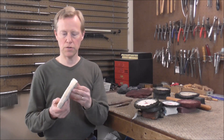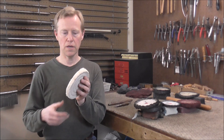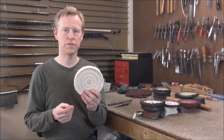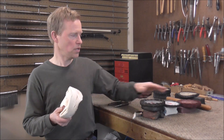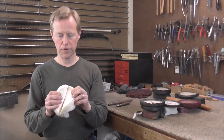The next one I use is similar but about twice as thick. This one works well with the Tripoli and Emery buffing compounds, and it's good at cleaning up dirty surfaces over larger areas. The other wheel is good for polishing — it's very loose and is usually used with the Red Rouge buffing compound for high polishing and to get things ready to lacquer.